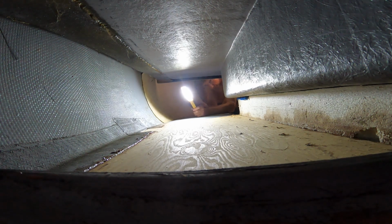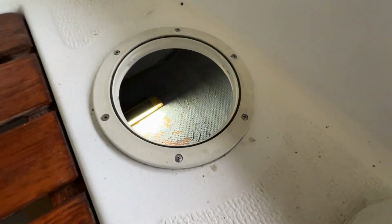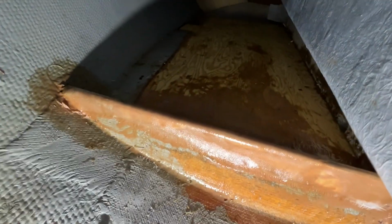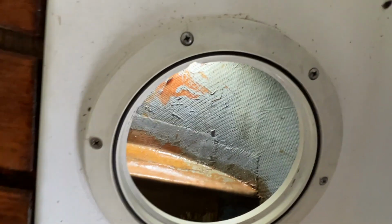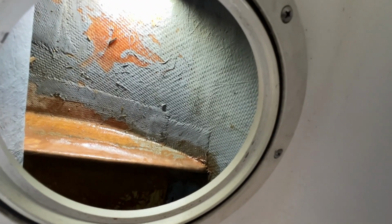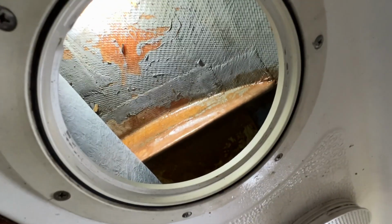That's including using thin epoxy on all of the edges and the bottom and all that kind of stuff. I'm still working on this Com-Pac 16. I just got through replacing this little, I guess you would call it a mini bulkhead, here at the end of the bunk. So you can see down in there. It's a lot easier to keep the old tabbing than it is to cut it off and then grind it all out and put it back. And this works pretty good doing it this way.